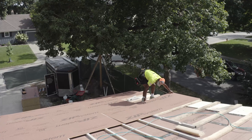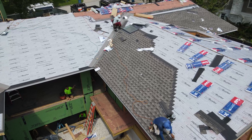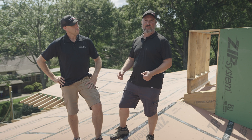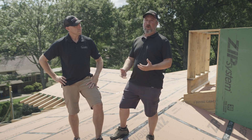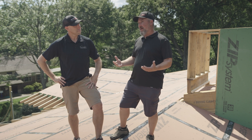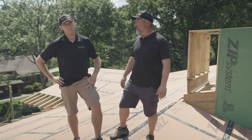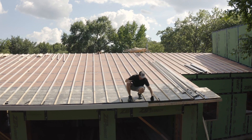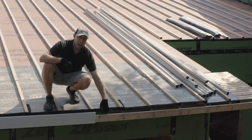One of the key points of doing the over-roof is that it gives a longer life to our shingles. In the Midwest we deal with hail and other things — you can't outguess natural disasters — but overall we're putting a 50-year roof on it. It's going to be well ventilated and should last the homeowner a really long time. It's the same way a rain screen extends the life of the paint job on your siding — you're doing a big service to your house when you allow for that back-vented situation.